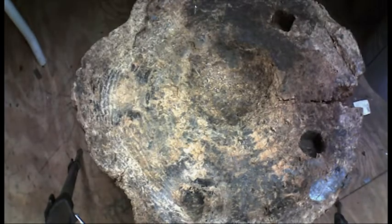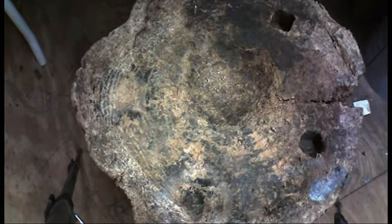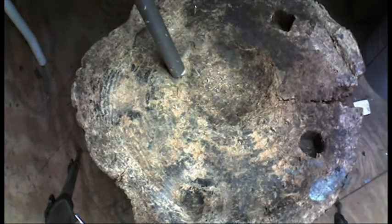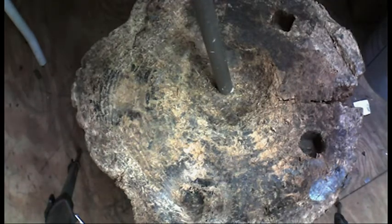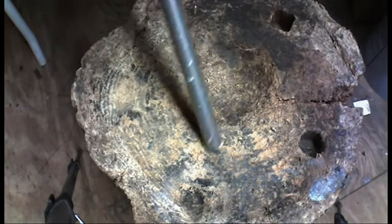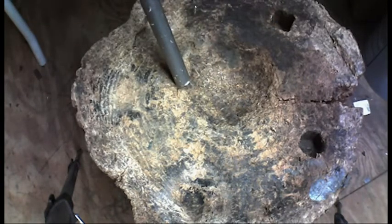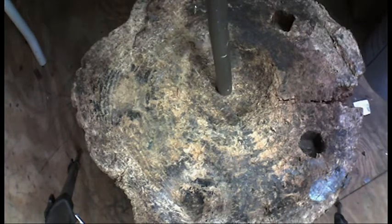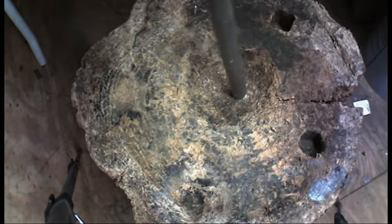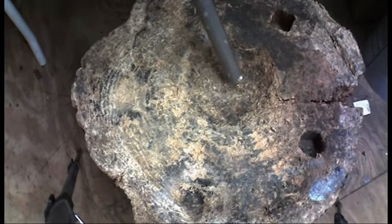This stump is probably about 18 inches by 15 inches - pretty big. I have three dishing areas on this stump. The major dishing area I don't really use that often - mainly if I'm working on a helmet or a male back plate. It's got about a 6-inch by 6-inch diameter, 2 inches deep dishing surface. There are very few things that ever call for it - it really comes more from my period armoring days, but I still use it on rare occasions.